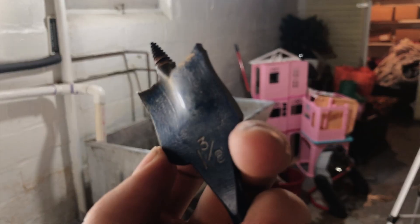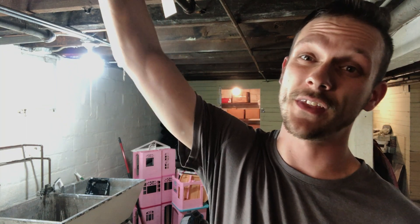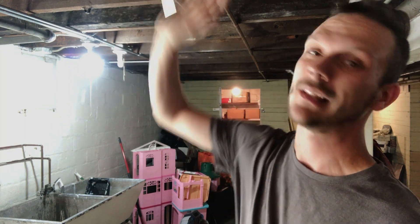This was fastened to the bottom. I'm going to repeat the same thing with the PEX. You could drill through all of your joists — you can do that either with a paddle bit or a boring bit. You're probably going to want to use more of a boring-style bit if you're doing a lot of these, especially since some of these are like three, three-and-a-half inches thick, and they're sisters, so there's a lot of wood to get through in an older house like this.